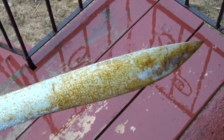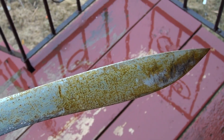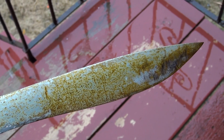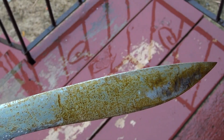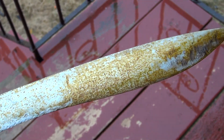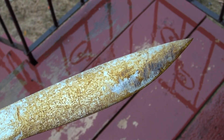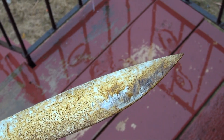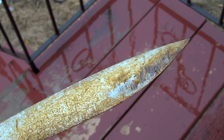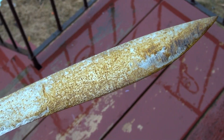And that's one of the curious things about stainless steel versus tool steel. With some stainless steels, once they start to rust, you'll get very deep pitting. With non-stainless tool steel, you tend to get very heavy surface rust, but you don't get that strong pitting. And that black stuff there is just what people normally call the patina — that's just one of the other forms of iron oxide, or rust.